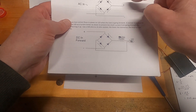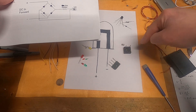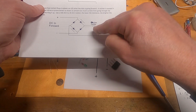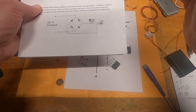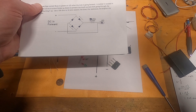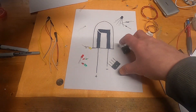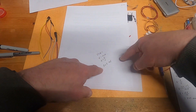To use the bridge rectifier with an LED, simply put the positive lead of the LED on the positive lead of the bridge rectifier. That's all you have to do — except for one thing: you have to put a resistor in there, or else you're going to burn up your LED if you're using more than the rated voltage. LEDs are generally rated at 1.5 volts to about 3.5 volts, so if you're using a 12-volt power supply, that's way too much and you'll burn up the LED.